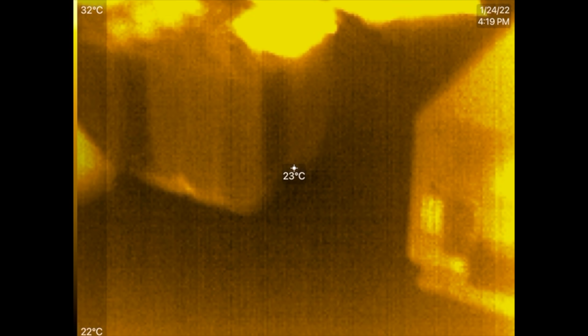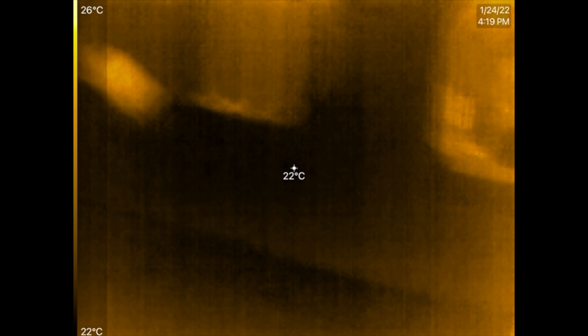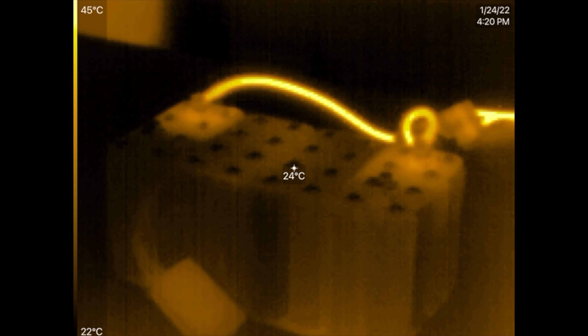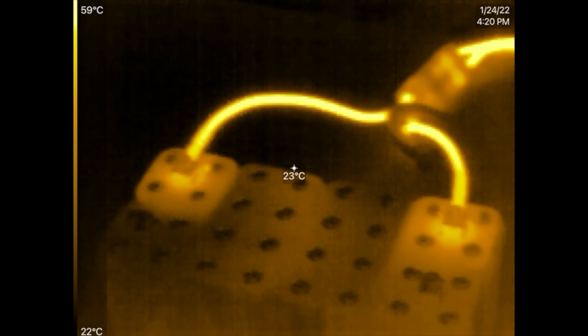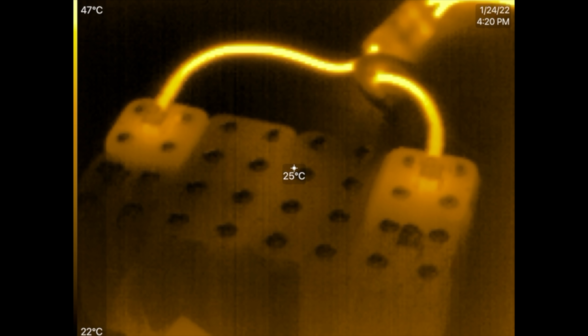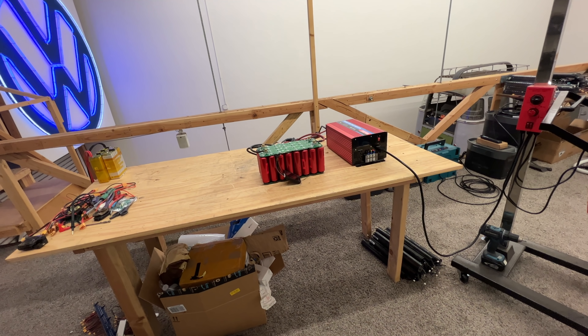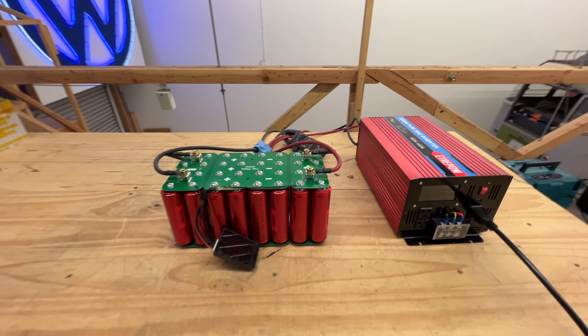The inverter fans haven't even come on. Look at that — the connector is holding out pretty well actually. It's just the actual cables — the six-gauge cable. So I'm going to go get another cable. I'm going to charge this battery again. These cells are starting to see some heat, but these are not, because there's probably some resistance in there. So if I get another set of cables, those cables will not be the source of so much heat.